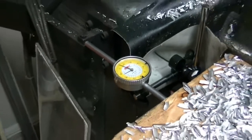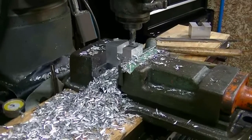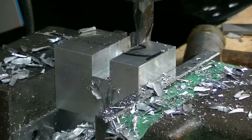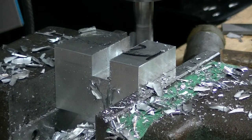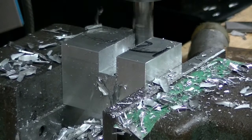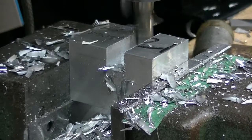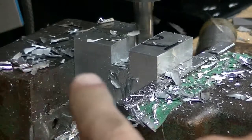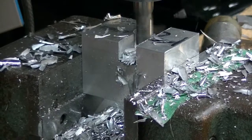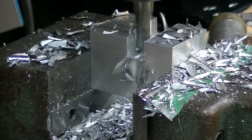This is half of my next cut. We'll maintain that RPM of seven hundred but increase the feed. Now this is what they call climb milling because my cutter is rotating in the direction where it would want to pull my piece in towards itself, so it could possibly pick up some backlash. But my machine's pretty heavy, the ways are pretty tight, I'm not having any issues. This will be climb milling and then my last cut will be conventional milling.